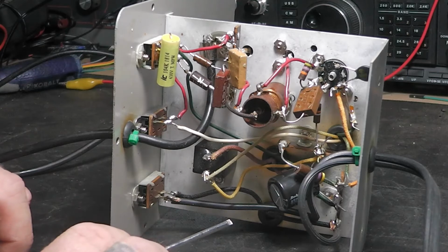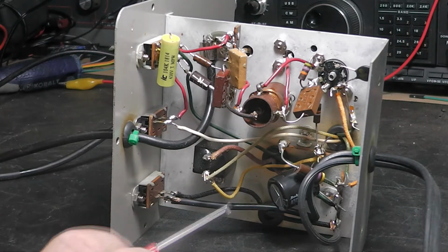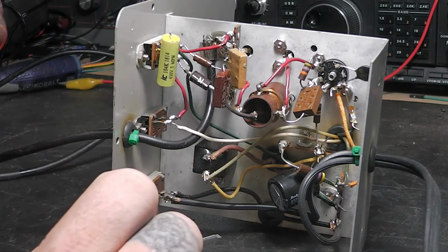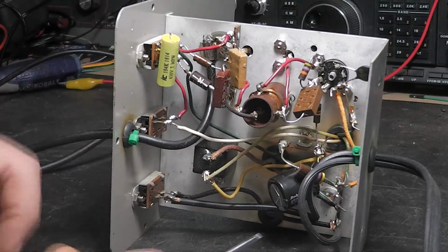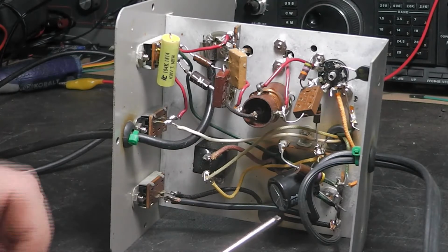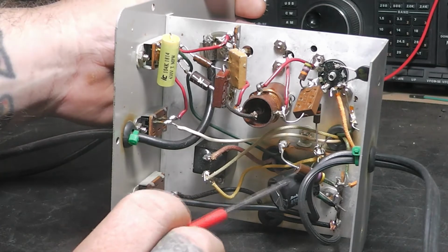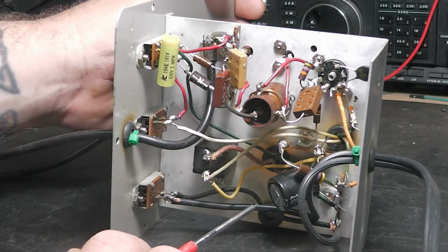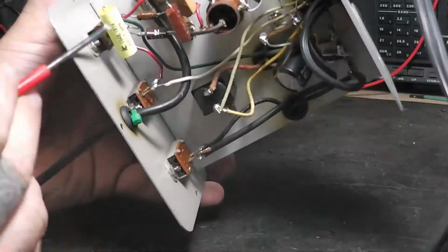You put 451 volts on that, it'll pop a lot of times. You'd better leave yourself some head space before you get to 450. And if it's a higher voltage circuit, put some in parallel or series-parallel, depending on what capacitance you need, because these new ones don't take kindly to going over voltage like the old ones did. But enough of that. So I replaced that, replaced this, and that resistor, cleaned everything up, and really had to go through the switches.